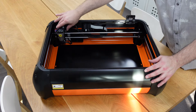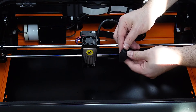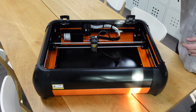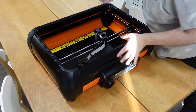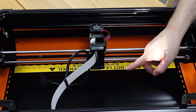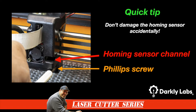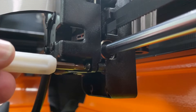With the power disconnected, you should be able to move the laser gantry without a problem. The next thing I'm going to do is take off the silicone nozzle and put it aside. The next step is actually behind the laser housing, so I'm going to turn this around so everyone can see what's going on. To get access to the laser, you actually remove these two screws — one is just underneath and the top one is accessed through the channel. Just be aware there's another channel for the limit switch that helps your machine home itself, so don't put anything in there.